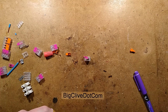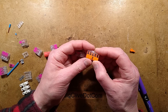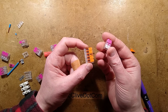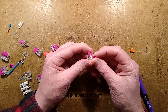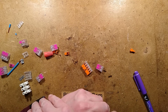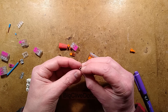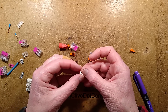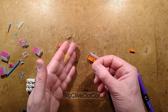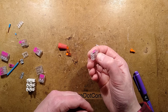They are both copper — which is good, because here's the problem: for commercial installation I would only use WAGO terminals, not clones, because you just don't know what you're getting. But for personal projects I would use the clones — though one of the first things I'd do is open one up, take the little bus bar out, file it, and check if it's copper or not. It is copper — well, copper coloured; it looks like tin-copper. But one day it's inevitable — these are going to come out with steel or aluminium bus bars, they're going to skimp, and that could mean the cheap connectors burn up.